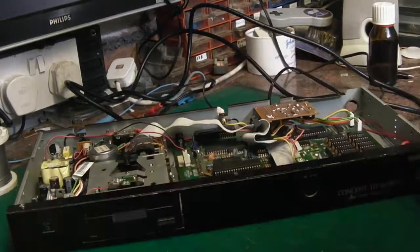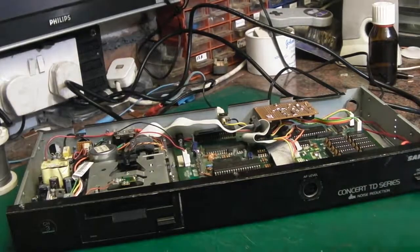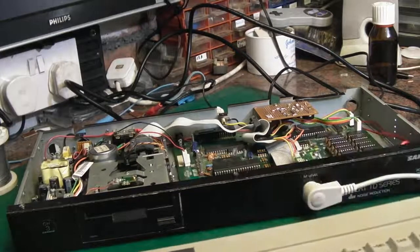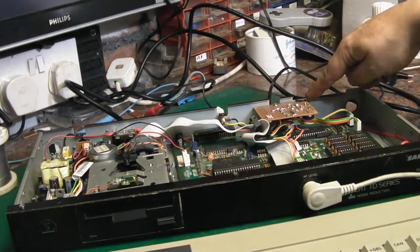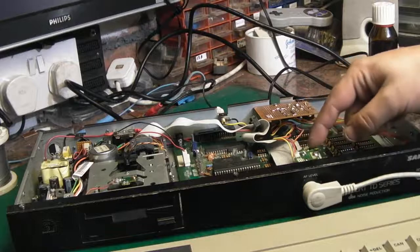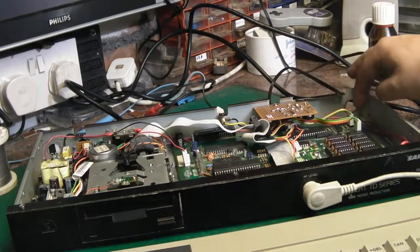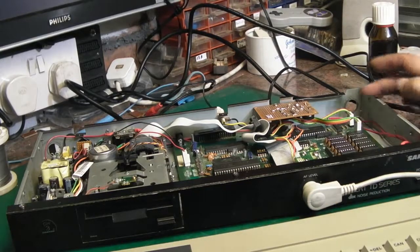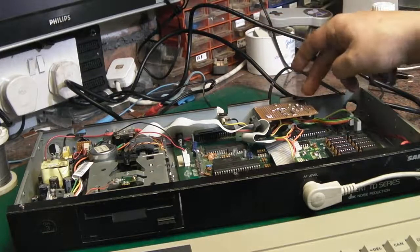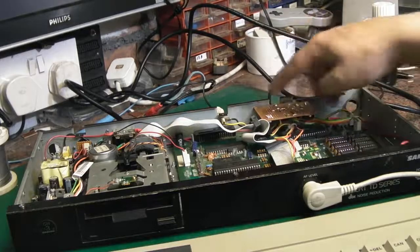As you can see I've actually got pretty much everything now installed in here. We now have the keyboard connector — if we have a look on the front there — and we can actually get the Amstrad PCW keyboard to connect on like that. We've got the video controller board that I made at the back there. I've desoldered the DIN connector off the keyboard and run a few wires off it, and mounted the control board on one of the little tags left in this case. I've run the cables over to the video processor board, because as you'll remember from previous videos, we've parasited the power from the keyboard connector onto this board which drives the monitor. The keyboard connector then connects through back to where it should go on the motherboard — it just steals 5 volts to use for the video buffer circuitry.